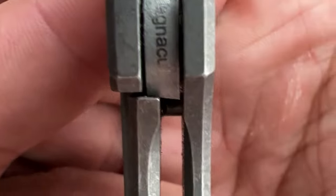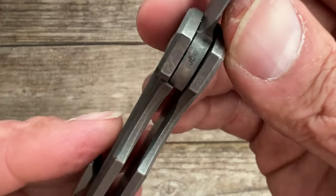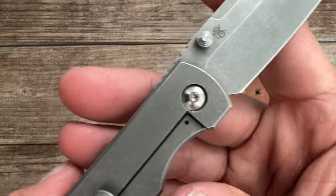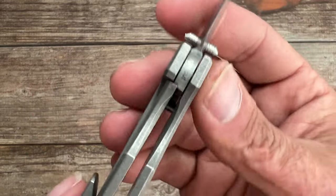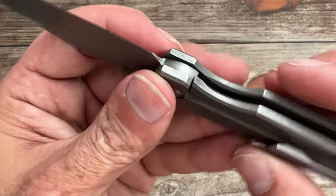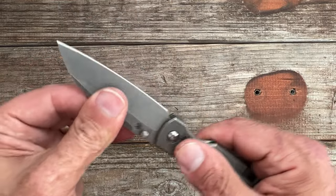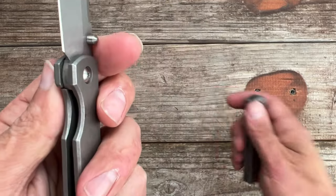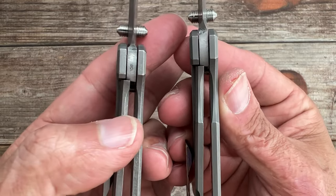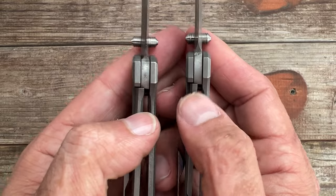Let's take a look at the lockup. Mine is sitting at around 40% or so. You can actually see the MagnaCut stamp right there. There's no hardened stainless steel lock insert, but I don't think it's needed. I've had my other one for a long time and it's done the same way. I'm guessing they either carburize the titanium like Chris Reeve does, or they're case-hardening the lock face. Either way, mine has no movement whatsoever and it hasn't moved a bit since I got it.